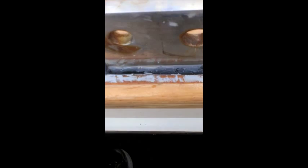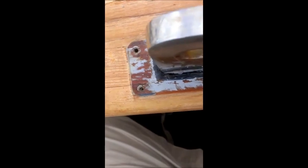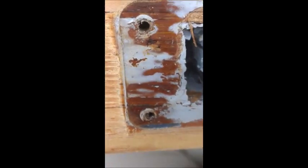We'll go ahead and start digging it out. I've pulled out most of the caulking. If you get in here and look around, you'll see we've got pretty good adhesion — a remaining layer of silicone, which is really what we're after. When we rip this out, we want to confirm good adhesion both to the stainless steel and the wood. Now I'm going to get in and scrape these surfaces clean down to bare metal and bare wood before we start building it back up.